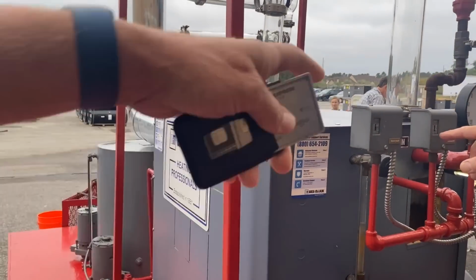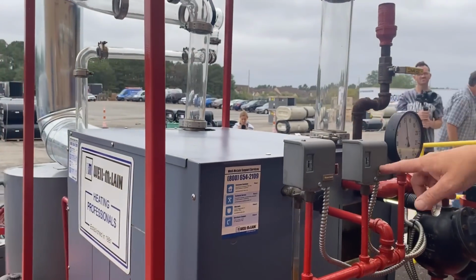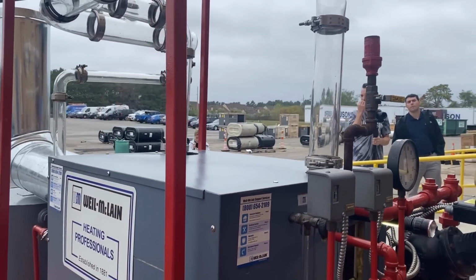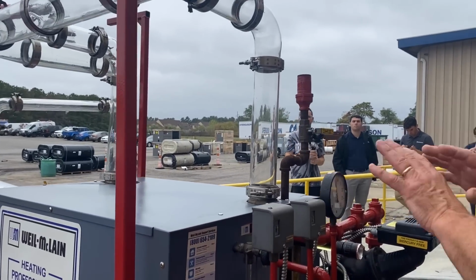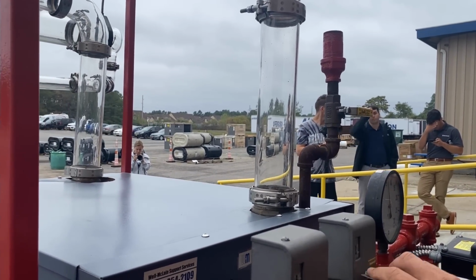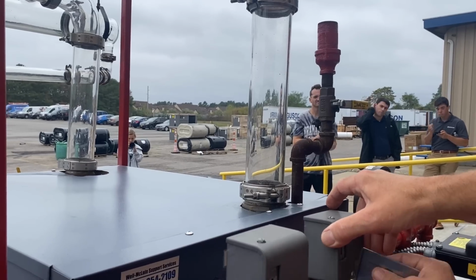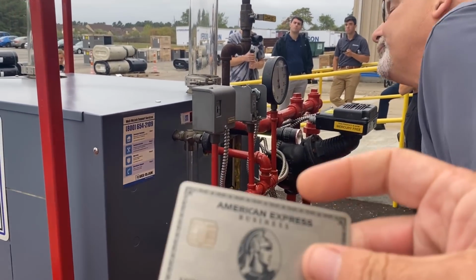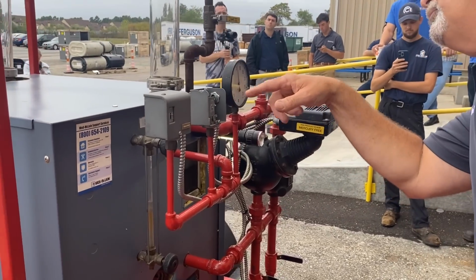So the cut in. We could turn the screw on top. I want to see what it says inside. It says like the cut out equals the cut in plus the differential. There are negative differentials that subtract, or subtractive differentials. Good. That should be enough. All right. So where does it say that? Cut out equals cut in plus differential.